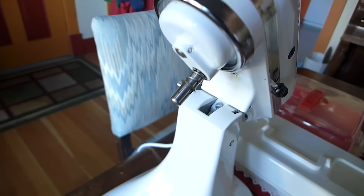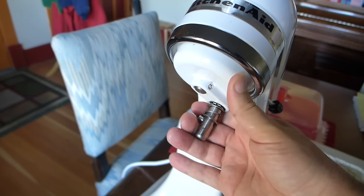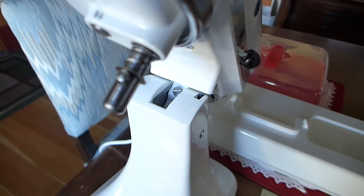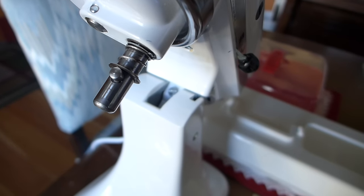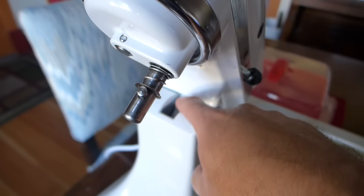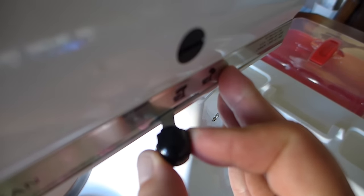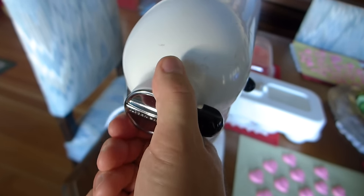You can very easily and freely move this screw in and out with a flathead screwdriver — you can use a short one or a long one. You may need to spin this to the side so it's out of the way. A long one gives more leverage, but either one's okay because this screw is not super tight. What I did was I screwed it out too far, and when I screwed it out too far, this lever would not go all the way forward — only maybe to here. Then I would screw it in little by little until I was able to move this all the way forward, and this did not move at all.